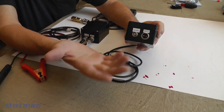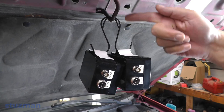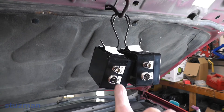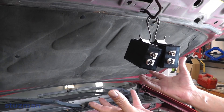The connectors on each side are identical to the other enclosure. One final thing I'm adding to the enclosures is a mounting solution, because I don't like enclosures laying on top of the engine where cables can pick up ignition noise from spark plug wires. So I used some velcro strips and S-hooks to hang the enclosure up on the underside of the hood — the coax goes out to the scope, the power cable goes to the battery, and the pressure transducer connector goes down, so all cables are lifted up off the engine.